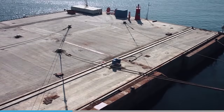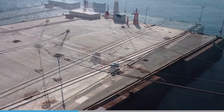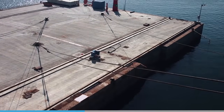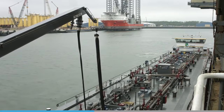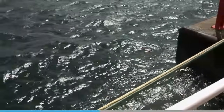Likewise, a previously secured line can slacken if there is slippage on a mooring bit or brake rendering on a winch. And a line parting can alter the tension of those remaining. Ship-to-ship transfer operations can also affect line tension, as can waves causing a vessel to roll alongside.